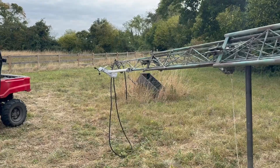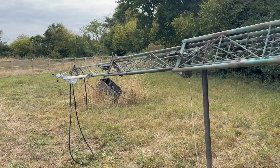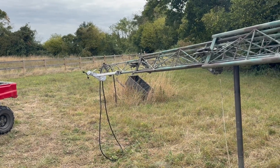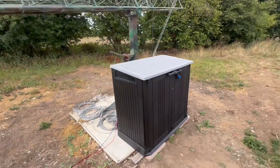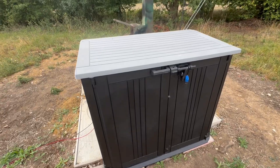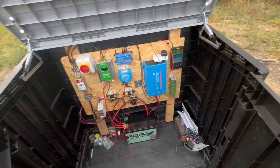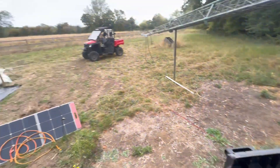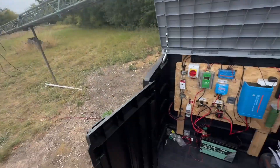I've got a three-core cable, it's six millimeter, so that should be good enough for a 24-volt max two kilowatt system — probably just pushing it, but I don't think we'll get to two kilowatt anyway. I've got a small receiving station in here where all the electrical equipment is contained, just for weather protection. These are cheap units off Amazon. This is a hybrid system — I'm currently just operating these three solar panels here just to keep the battery topped up whilst I get the wind turbine up and running.